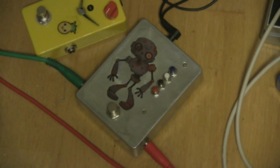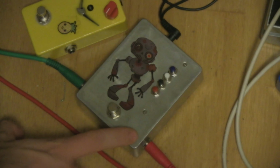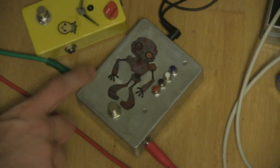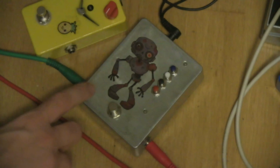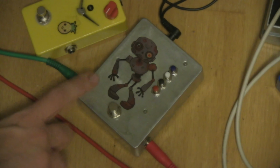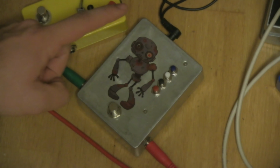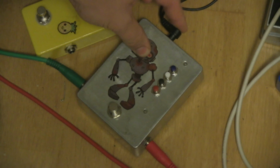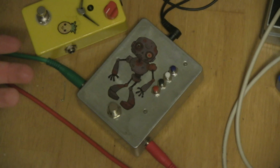The second thing you have to do is, obviously, remove the microphone and switch it out for a jack, which is just for the guitar cable in. And then where the speaker is supposed to go, you have to put another jack and just make it the jack that goes to the amp. And then finally, optional of course, you can make a plug-in where the 9-volt battery goes and switch that out for a plug for cable wire.